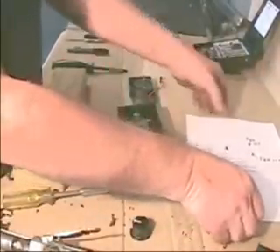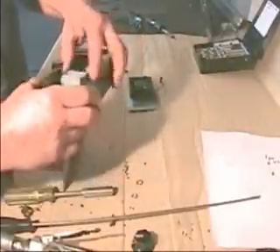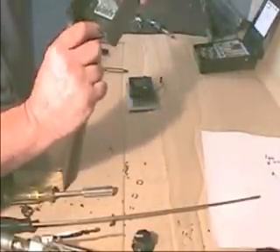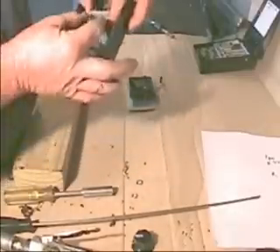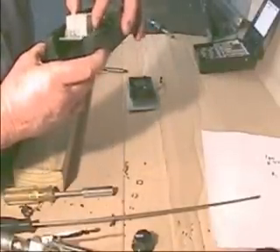The instructions on our website show you the wire diagram for the pulse width modulator — they're very clear. You've got a 12-volt positive, an M-plus, an M-minus, and a ground wire. That covers the pulse width modulator connections. We're going to hook the fan in later and show you where that hooks in — it's going to run right off the power when you put the key on. You can just push the whole board in, let the wires come out the back, and hook it up.